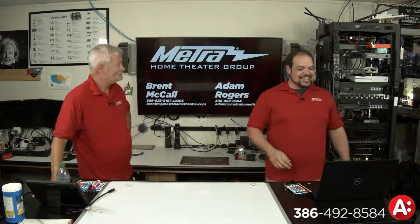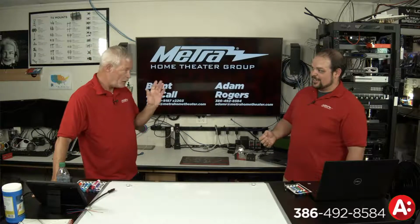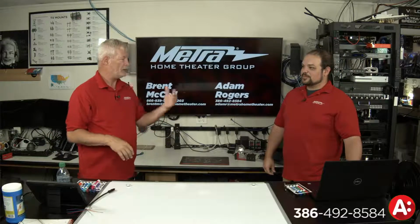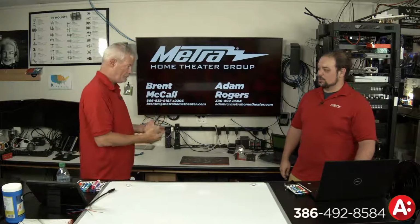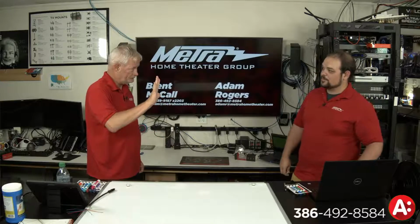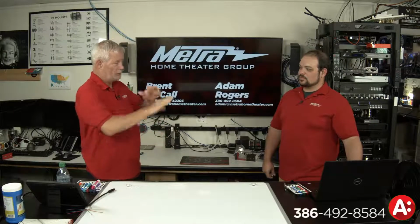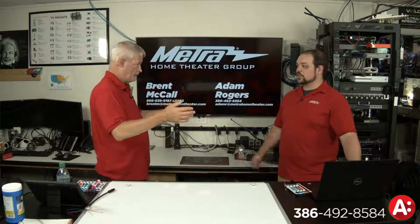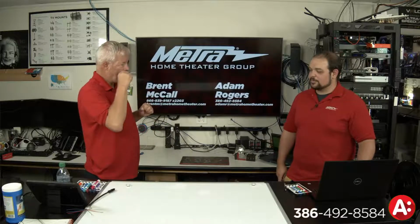Anyways, how do the TMDS channels work together? Currently, it's basically component digital video. For years, we looked at RGB, a component cable. You had a red cable, a green cable, and a blue cable. And prior to that, we had VGA. We had RGB, horizontal, and vertical sync. There were 5 conductors. So, again, the 3 colors, then a sync for this and a sync for this. Component took this sync and overlaid it on the green, which is how composite did it, except it also added in all the others together. So that simplified it from a VGA terminal down to 3 RCAs.